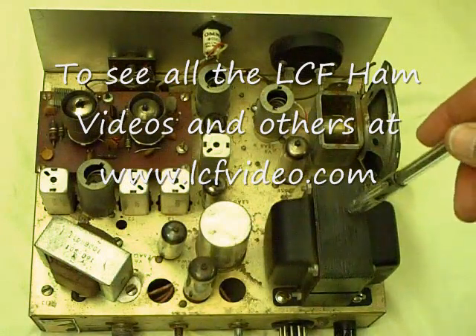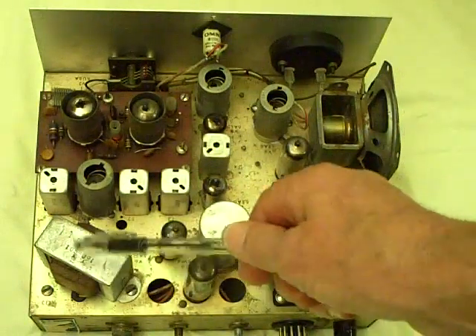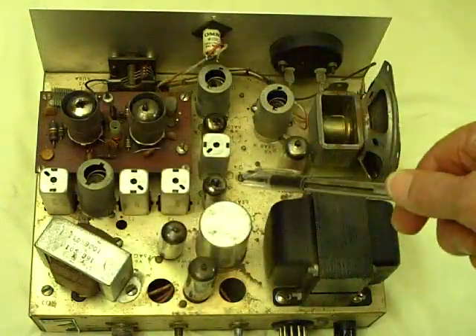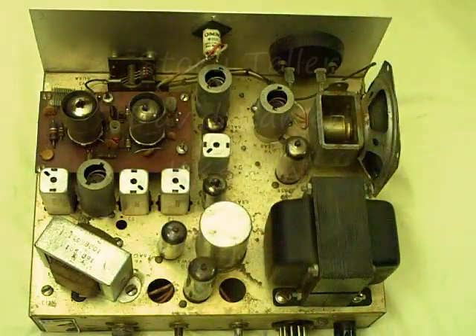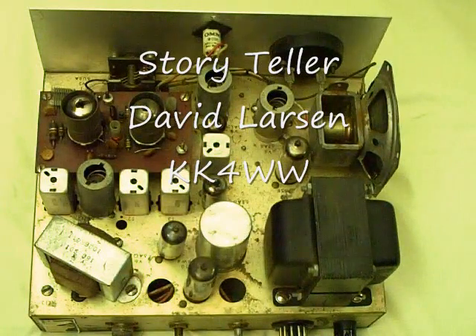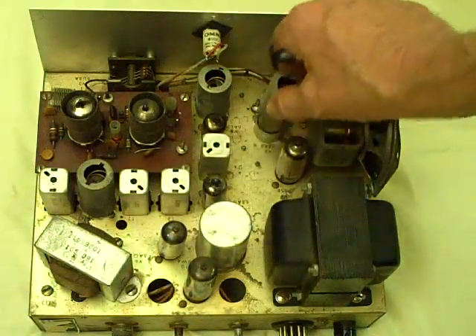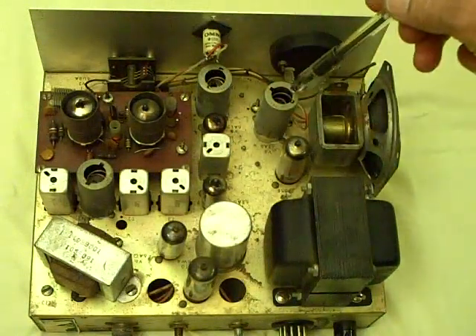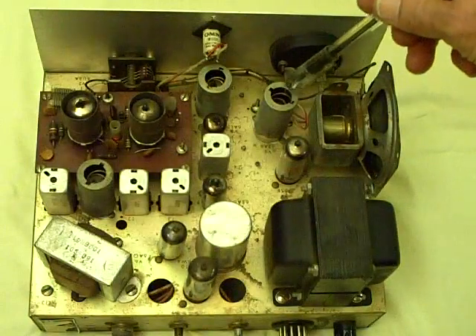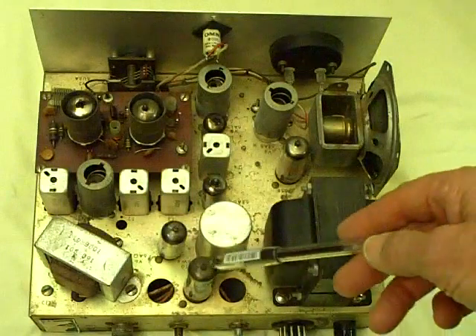There's the power transformer, which produces ultimately several hundred volts plus a low voltage. A modulation transformer is needed for the AM — amplitude modulation — operation. There's a tuning capacitor back here to change frequency. This unit operated on 6 meters, which is around 50 megacycles in frequency, and it only ran a few watts of output power — very low power. Some of the tubes were shielded with metal cans that shielded the electronic activity inside from the surrounding components. Notice some of the tubes required a shield and some did not.